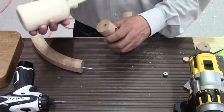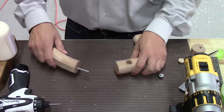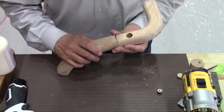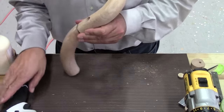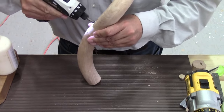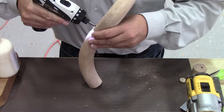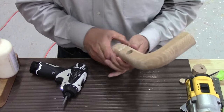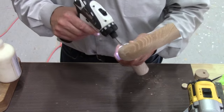The next thing you do is add a little bit of glue on that end and a little bit on the other, then stick those two pieces together. Pick up the patented gear head for the micro, slide that down into place, and using the 4mm hex with power, tighten that head right up and get it nice and snug. Check everything — the alignment, the flat spot at the bottom, the round rails, where it should be — then finish tightening that up with the gun, and you're done.